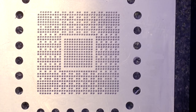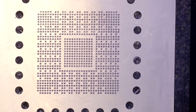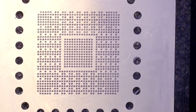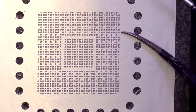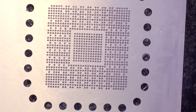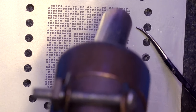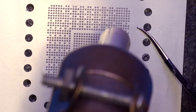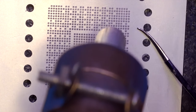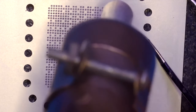Let's wait until the temperature is right and the tip heats up. Use your tweezers because the stencil could be a little bit deformed by the high temperature — it's not that high, but it could deform — so just to be sure the surface stays flat. We will begin from one corner of the stencil, heat it up, and then the balls will form from one end of the stencil to the other.